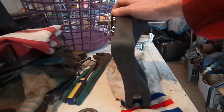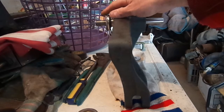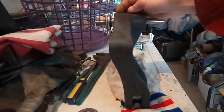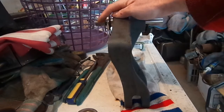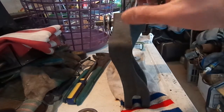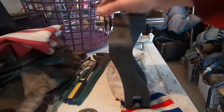And always do the flange side first. If you put your bearing on over here first, you're gonna be messed up. So the spring goes in the cup before you do any of this, so you're all set to go. And so your bearing goes on the shaft, and that seats all the way up against the shaft's got a larger center, and so there's a shoulder there for it to press up against. So you do that, and then take your washer off,